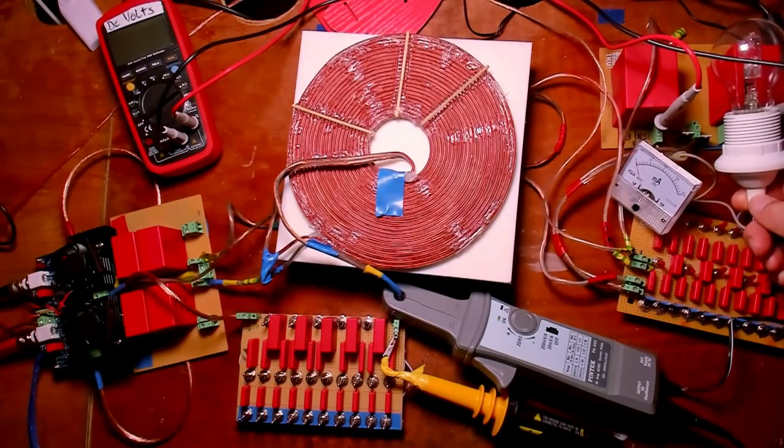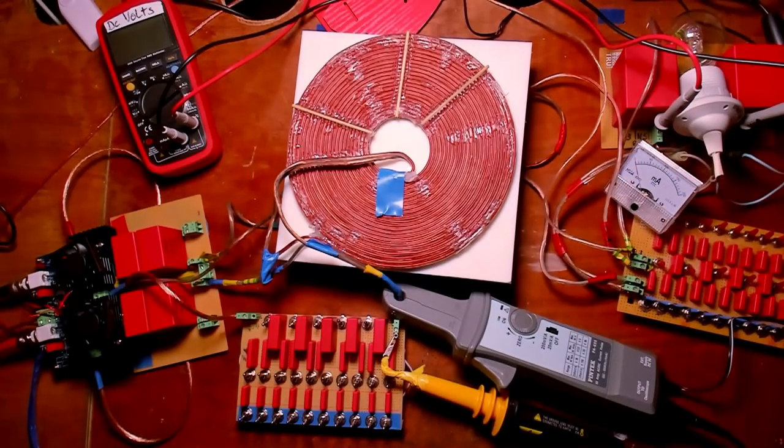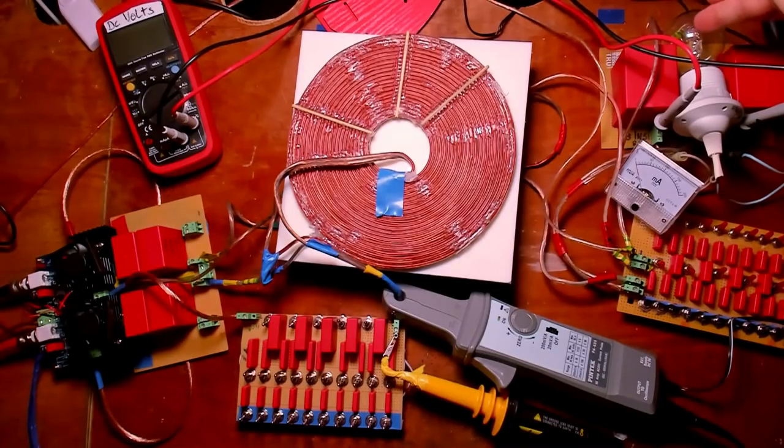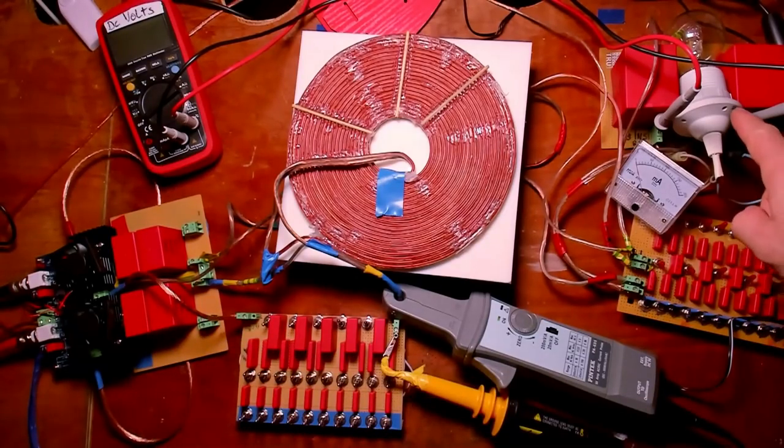It's a half bridge rectifier because I only use one wire power transmission because the other side is grounded. Then I go into a positive capacitor and a negative capacitor. So this turns it into positive DC and negative DC via the diodes, which again are ultra fast. And in between the capacitors is again an earth ground. So we got series capacitor with earth ground in the center, just like the power supply. And then we have a lamp that's loaded on the capacitors.